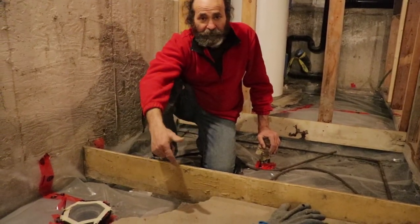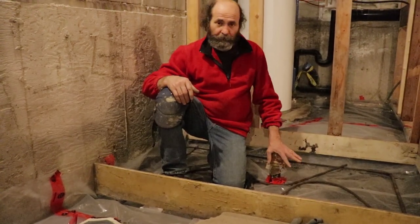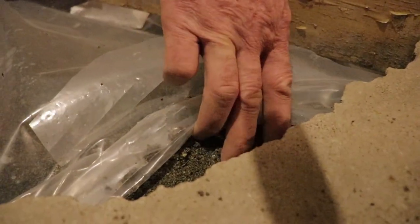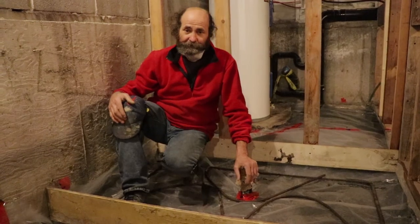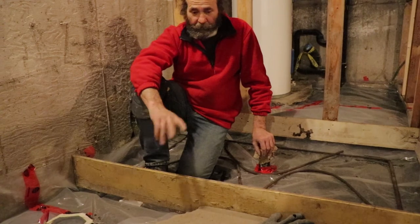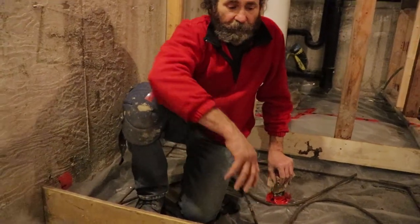The process was to break the concrete. We used a saw to cut a straight line and broke it with a chipping gun or jackhammer. Then we have the drain. We put some sand to level it up — you can see it, we put some sand and compacted it. We picked up half a yard of sand from a landscape supplier, which is plenty to do this job. Then we put the vapor barrier.